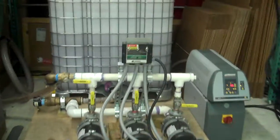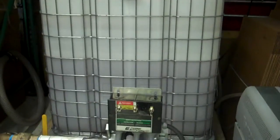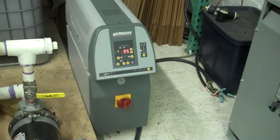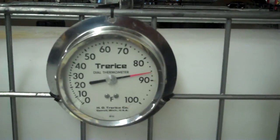In the back of our chiller over here is our test bed. Basically this is about a 300-gallon tank, and we have an electric heater — a mold temperature control heater — to heat the water. Right now we have it up to about 86 degrees Fahrenheit, a little bit more.